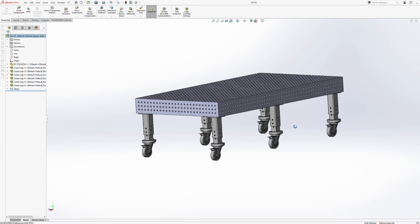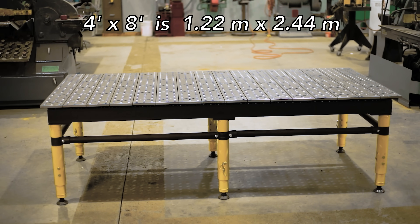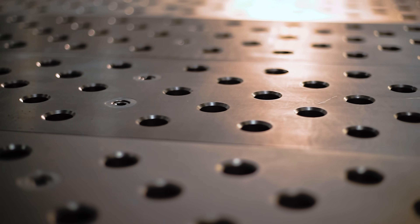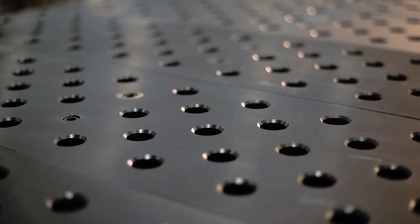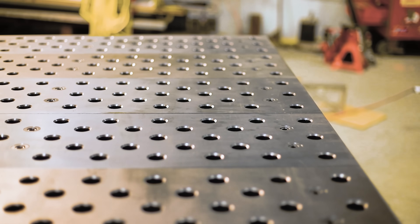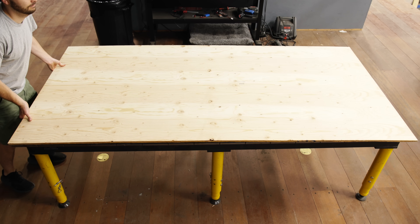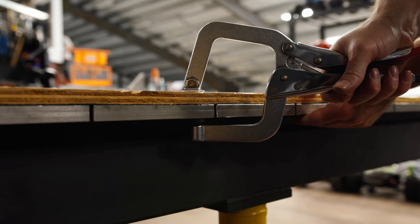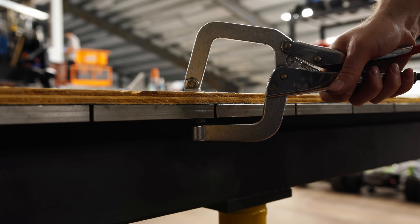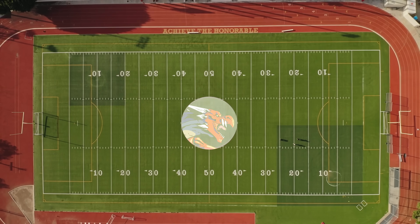Let's talk about the problem of size. Most of the tables were 4x8, so I asked myself why are they 4x8 — is there a reason behind it? Nobody could really give me an answer. What I suspect is that the material they started with was 4x8. That poses a problem for us welders because our material is also 4x8, which covers up the whole surface. And the 4-foot dimension is really common when building gates and railings, so why have a table that's exactly the same size as your material? It just doesn't make any sense.